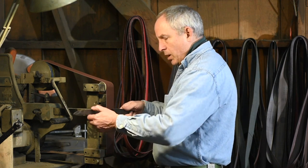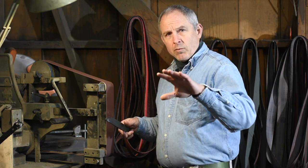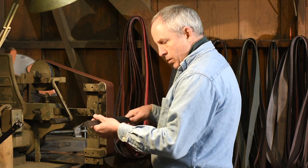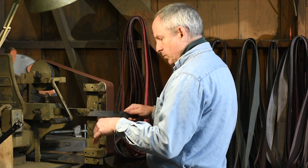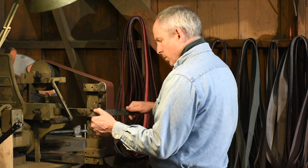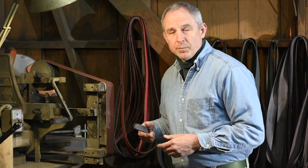So to maintain that exact angle, you have to keep the blade at a precise angle all the way down. If you're not going to use a jig, that means you have to maintain a very precise angle — within probably half a degree — in order to keep this angle looking correct all the way down and to keep good grind lines. So you can't be loose and floppy in the course of grinding. Circling back to what I was talking about with the angle grinder, the same principles apply. I've got my elbows locked in, a firm grip on it, maintaining pressure with my thumbs and fingers, moving back and forth in slow measured strokes down the blade, keeping that angle very precise because I'm locked in here and driving it all from the hips.